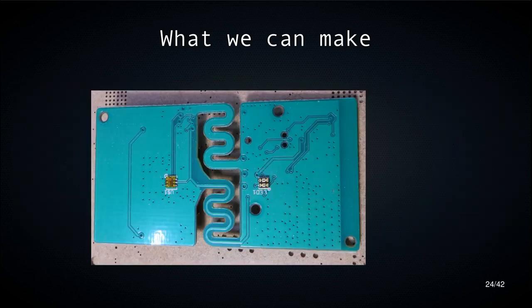there's one thing to be aware of. They're made with a milling bit. And a milling bit is like a drill that can travel around. So it's a circular thing, it's rotating, which means you cannot have sharp inside corners. So like here, you have the milling bit going around along this curve, and it cannot make a sharp corner in here. And similarly, it cannot make sharp corners in here.